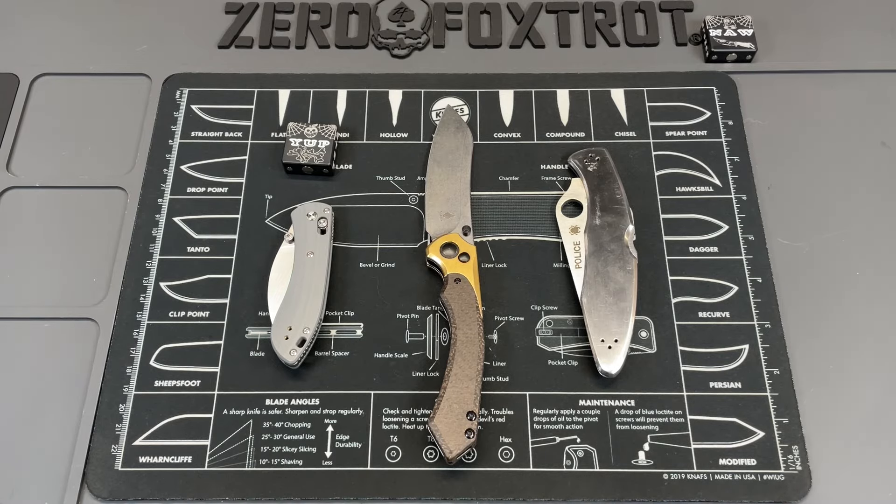I still like some of the super steels — the ones I mentioned I still love, and some are my favorite steels. I think some of the finer grain structure steels would be great for things like wood carving knives, chisels, or straight razors — where you want that super fine edge and smaller carbides for a cleaner finish. But for the things I do with a knife, I like the more aggressive, inconsistent carbides. Those inconsistencies are the things I love about them.